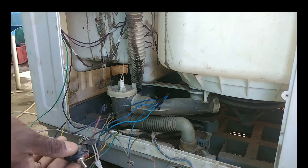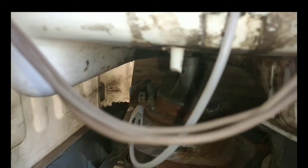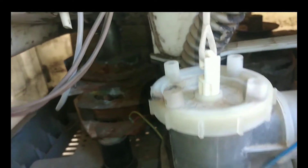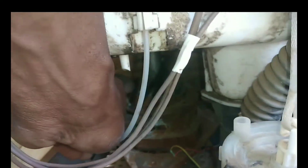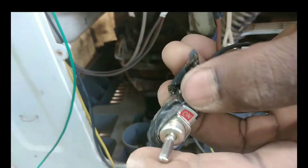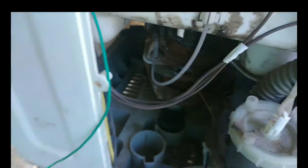You can hear nothing — just a humming sound. The motor is on but it cannot spin, which means the motor fails. I noticed the brake release cable was loose and the brake was still forced against the coupling. I tried to release it and tried to help it spin by hand — nothing happened. We're still getting the humming sound. The motor fails.